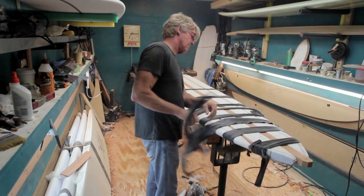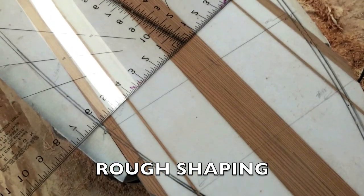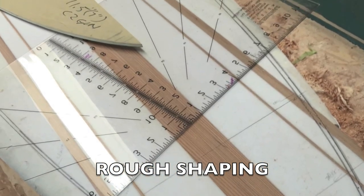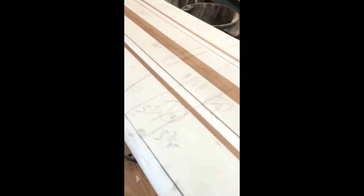I'm going to be chambering this whole board and filling it with lightweight foam. At this point I measure and mark up the blank, noting and circling the differences between the blank and the finished board. I study this for a few minutes so I know where I'm headed before I skin the blank.